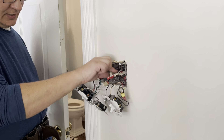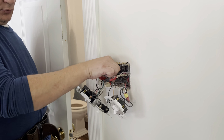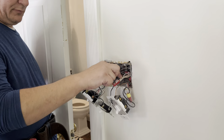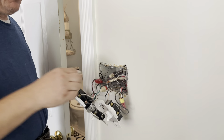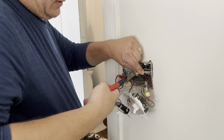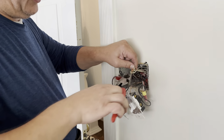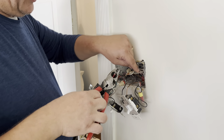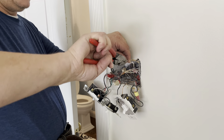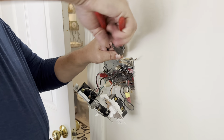I need to break apart the neutrals, but I'm trying to find out where the hot wire is coming from. So this is the hot wire pigtailed to these two — this brought in its own hot and it's tied to several others. It's also passing power. So there are two neutrals we have to break away. This was the first circuit; this was the second one we turned off. They've got two blacks pigtailed to a black to power the switch. So they've got power in and they're passing power, but there are two neutrals we have to take apart, tie separately, and keep them separate.